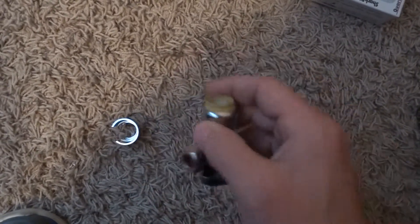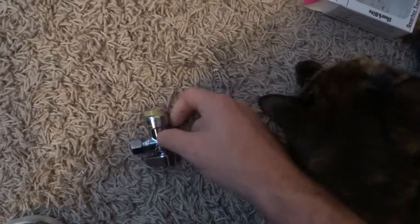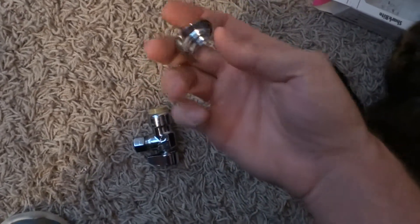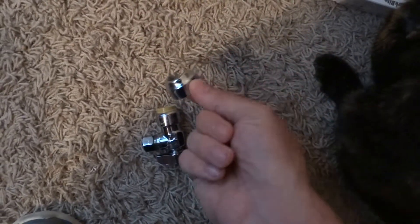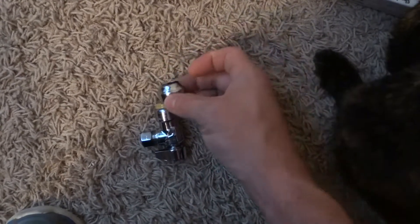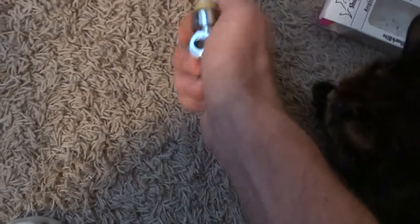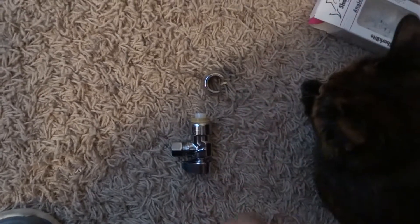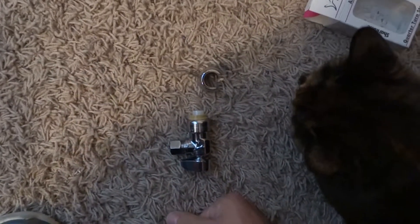There's a tool — it's an orange tool that looks similar to this. If you have to take this off to do some maintenance on the line, there's a little orange fitting that clips around the pipe. You run it down the pipe, you go over this and you twist — it disconnects it and takes it off. So if you put the wrong fitting on and need to put another SharkBite fitting on, you just disconnect it and put it back. It's that easy.